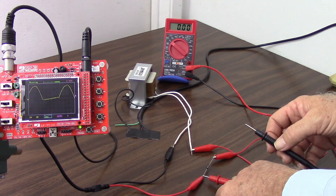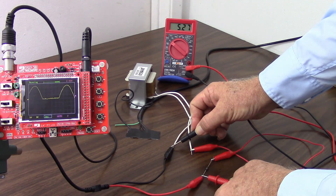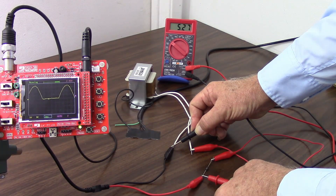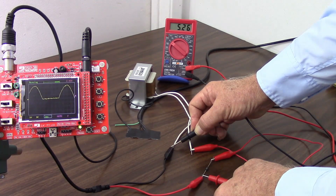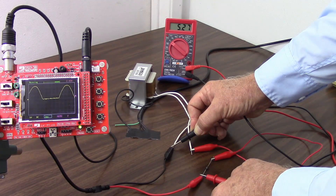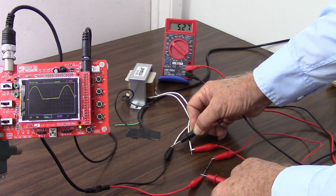I'm going to touch the red lead to the oscilloscope red, the black lead to the oscilloscope black, and we have 5.27 volts — 5.27 volts RMS? No, this is not a sine wave, so this meter can't give us the real RMS value. It's not a true RMS meter — not really a very meaningful voltage, although it gives us an idea of how much energy might be in this half-wave rectified wave.